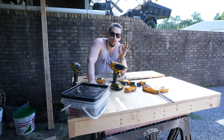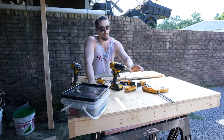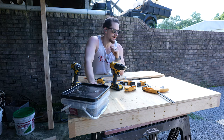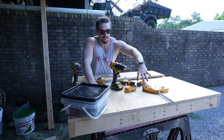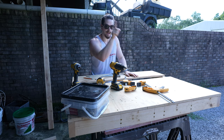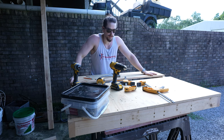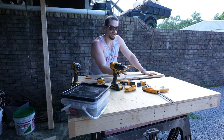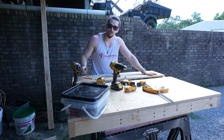Before we put the pulley on there, one note that I want to make. Rather than putting the pulley in the dead center of the box, you actually want to put the pulley a little bit forward of center. Since you're going to be standing in the center of the platform, if you put the pulley in the center of the platform, then the cable is actually going to be going behind you so that it can loop around and then go to the other low pulley. So you need to have it a little bit in front of you so that the cable itself is coming straight up.